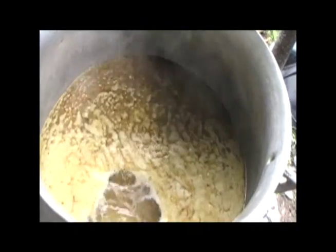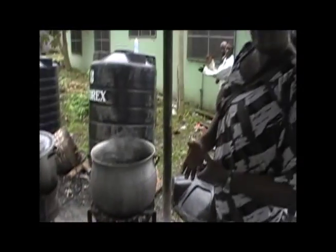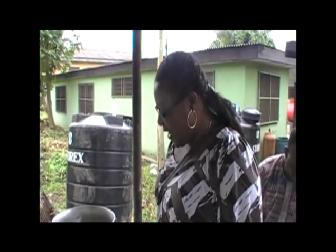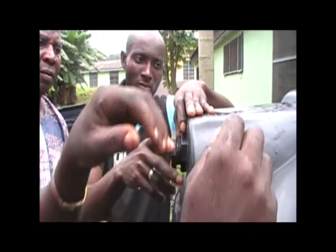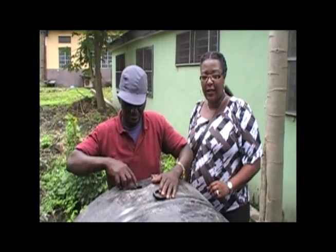Right now we're heating the pipe that's going to bore a hole through the side of the tank so that we can fit the esophagus into the stomach of the digester, the base. I'm looking for the back nuts of this. Once it gets hot enough to melt plastic, we can push it through and be able to fit the right size pipe. Just screwing it through. We're plugging up the bottom drain.